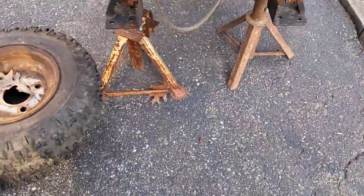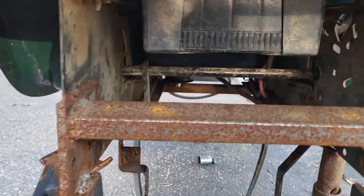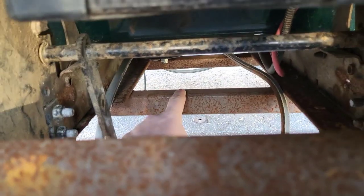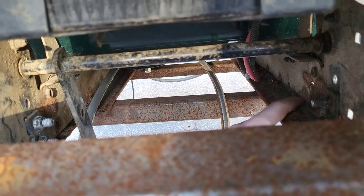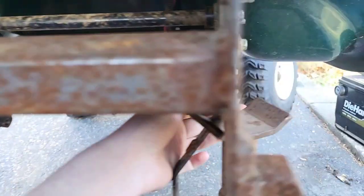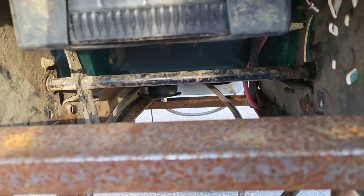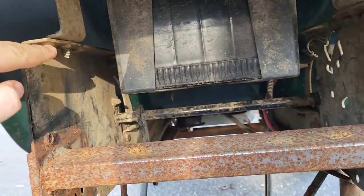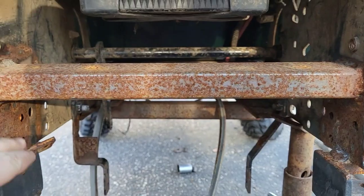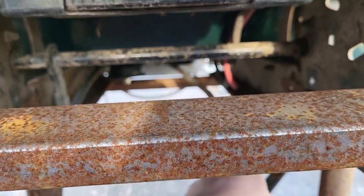I'm currently working on figuring out the frame — it still has a little bit of flex even after I added a couple braces, so I want to try to add a few more or move them to a different location. What I want to do is cut that off on both sides, then weld the flat part of the angle steel on the inside with a nice big bead all the way up until where this brace is here. I want to move this brace up a little bit so it's connected to the flat part of the frame to try to get more grab. I'm going to work on marking that up, but that's probably not a today thing — I want to try to get it on four wheels first.